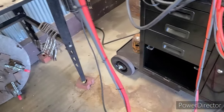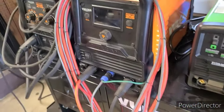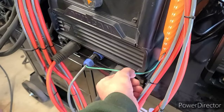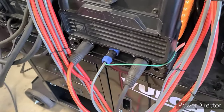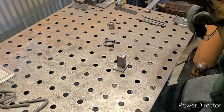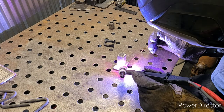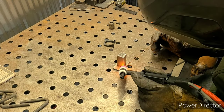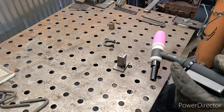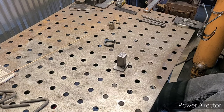I had the button mounted and the cord zip tied all the way around the new flex hose. For that ground they included, I attached it right here onto the frame — I've got to say they give almost no extra room for that wire, but it's long enough. And hey, good idea — turn on your welding hood before you weld. This metal isn't exactly clean; I did notice a little bit of wavering in that arc. I might just need a little more gas.